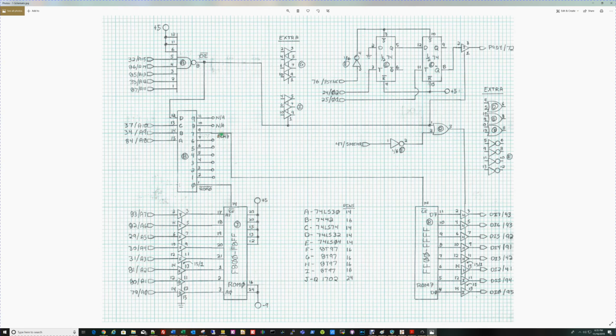Once I'm convinced those are working correctly, I will most likely add the wait state generator here. Every time I do a read, I should see a pulse appear here on Q, where it'll go high, put the machine in P ready for 2 clock cycles, then drop low, and the machine can continue running. So probably wire that up next.